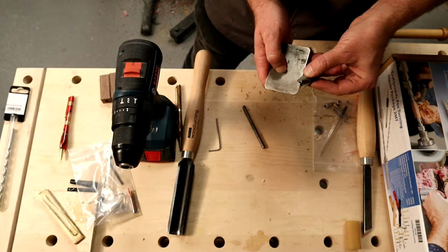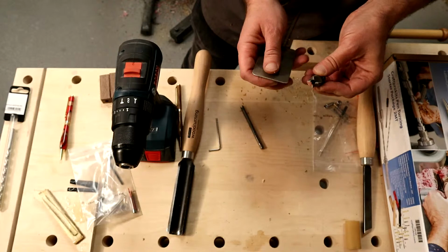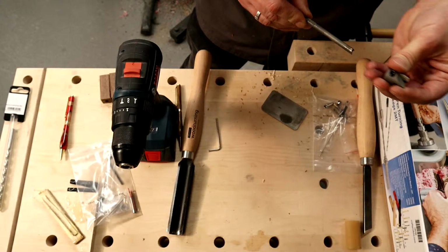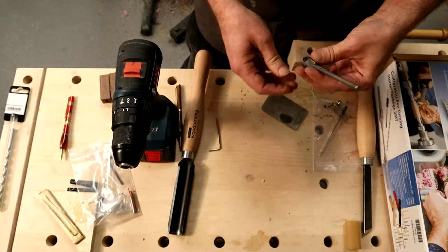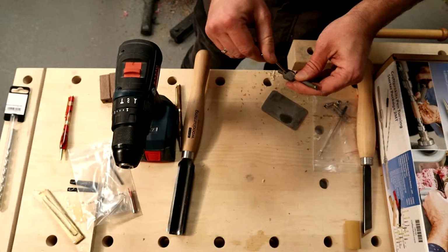Okay, so we're actually taking material from the flat to come back up onto this really difficult thing to sharpen. So, yeah, always go from the flat, give it a little tickle. And like a lot of these things, it's better to keep it fairly good than to let it go really blunt and then you're up against it. Just like your carving knives, carving chisels, always worth having a little tweak every now and then. Okay, so that's your barrel trimmer.